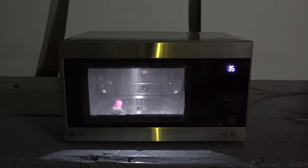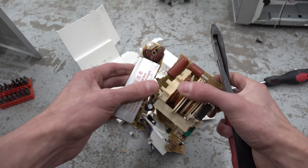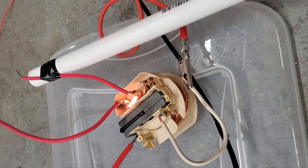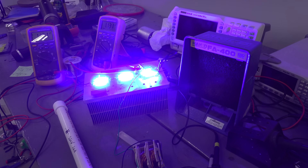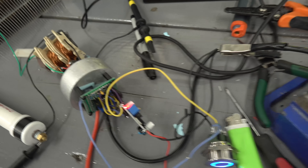Along with making them lighter, this makes them more efficient and also has the benefit of giving true power control when cooking food. This flyback transformer will easily be able to power the laser array, but it is going to need some modifications, as well as a new driver circuit to run it. It's funny, because if you try to run one of these open circuit in flyback mode, the voltage gets too high and causes the windings to arc over, which destroys it pretty much instantly. Anyway, I've made a prototype drive circuit using a microwave flyback as a boost inductor, along with a MOSFET and 555 timer. And because this thing is so unbelievably cursed, I'm testing it with some cheap LEDs before hooking up to my very fragile and expensive laser array. And it works! So that means it's time for the real magic to happen.